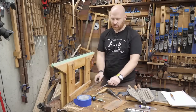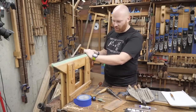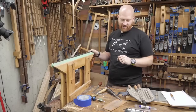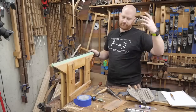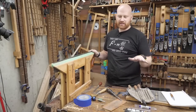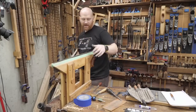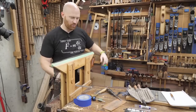What size? A lot of people are going to say this is a 5 PPI handsaw, and so for that you need to have a 7-inch regular or a 7-inch slim or whatever size. And I really don't subscribe to that, saying that you need this size for that. What I do is I take the file and I set it in there and I see if it matches what I want it to do.